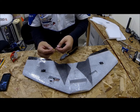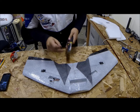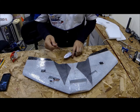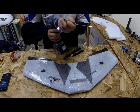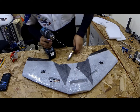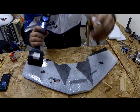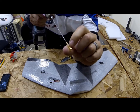So we're going to attach the metal clevis to the control rod. Here's a really cool trick: use some pliers to get the clevis threaded on there, just starting the thread. Then grab your drill gun — I don't want to sit there and thread that all day. Take your pair of pliers, hold the end of it, and just watch it thread through. I like to thread it in about a quarter inch out through the clevis.